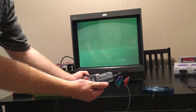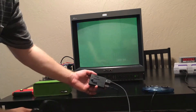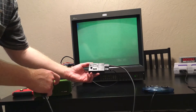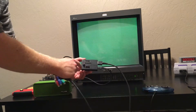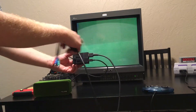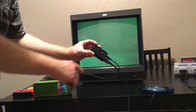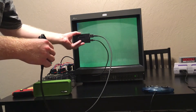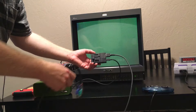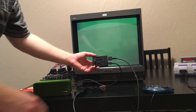I have an HDMI to component converter that he recommended on his site. For those of you who aren't familiar, what the Time Sleuth does is it has a knob that will switch between 240p, 480i, and 480p, and it will output that signal to a monitor. On the back side, it has a photodiode that will detect the signal blinking on the screen, and it will tell you how much latency there is between when this device is sending the signal and when it detects the signal.